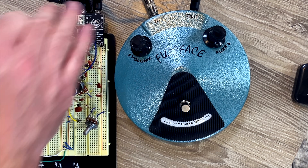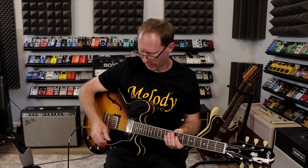Let me explain this a bit. With a Fuzz Face type of circuit, it works really poorly whenever you use two JFETs in that circuit. So you have to use the standard transistor you'd normally find in a Fuzz Face, and then a JFET after that — they both work together as one gain stage. That's just the way it works without getting into a lot of detail about impedance and other things that would probably make you stop watching this video.